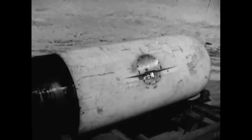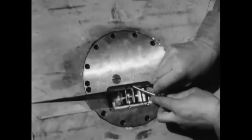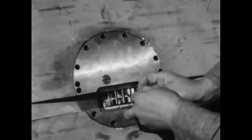Similarly, high speed and altitude make it necessary to prevent the impeller on the exploder mechanism from turning while in flight. A piece of .020 annealed soft copper wire is used. Impact with the water will shear the wire.